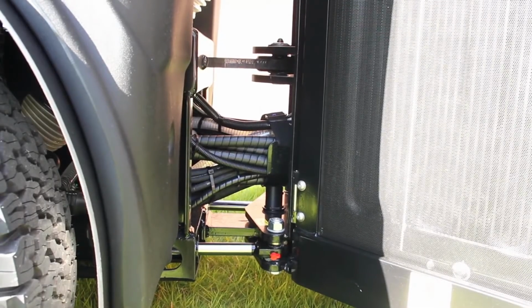First thing to note on the center articulation is the turning angle. So the machine can achieve 50 degrees turning angle left and right, which gives that amazing turning radius that the unit has of 1200 millimeter or 47 inches inside turning radius. Next thing is that the machine has dual steering cylinders, which helps with giving a very strong turning force, but also a stable ride. Then you will see how cleanly routed the hoses are through the center articulation.